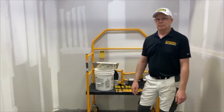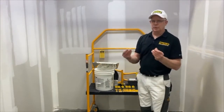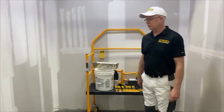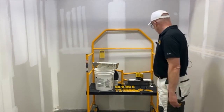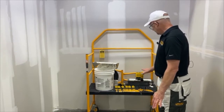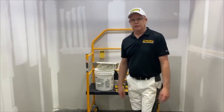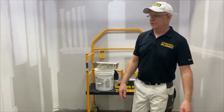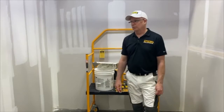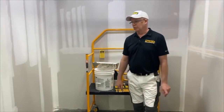When you use them and put them on the wall — I didn't do any sanding. Some knives you have to sand off the edge, they've got some coating on them or you have to kind of work with them a little bit. These blades are precision ground. The grips feel really well as well. If you're doing this throughout the day, the week, the year — grip is really important on anything, certainly on finishing drywall. That's why most people grab the blade — the flexibility of the blade and the grip is really good on these knives.